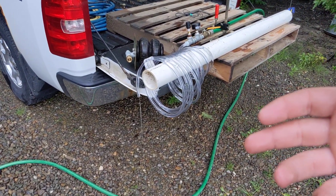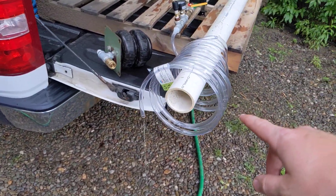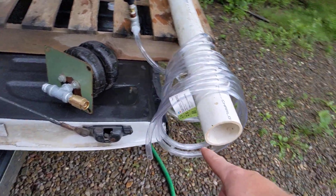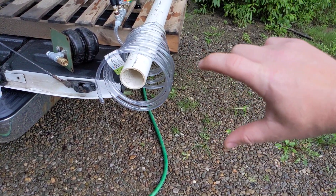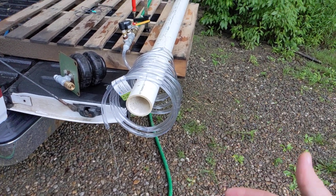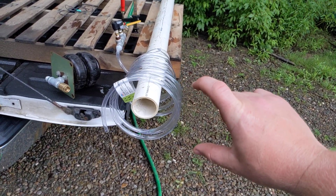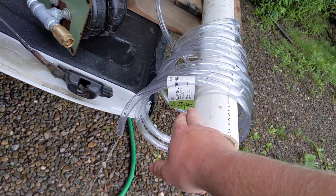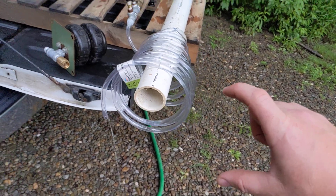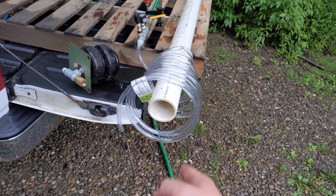So now I just need to make it bigger. This is 20 feet of pipe. Even if you made these sections taller, you wouldn't necessarily get more pressure out of it, because you only have a column of water on one side. The column of water you can generate would only be about 10 feet worth of water column, even if it was perfectly vertical.